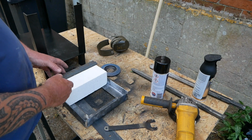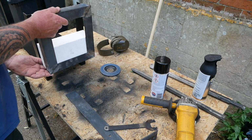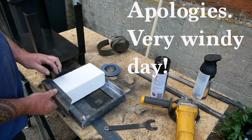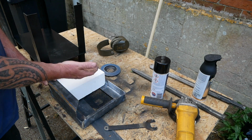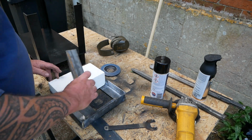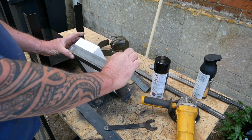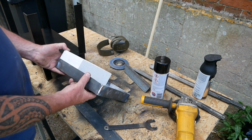So one problem that I've worked out here is that if I want to close the gate like this, there's no way of me putting a hinge between that, and I'd like to avoid putting another piece of angle iron on the inside, because then it's going to be a problem getting a nice clean fit, although I could cement on another piece internally. But I'm wondering if the easiest thing to do would be to cut a piece, a flat, weld it here, along here, so that I'll be able to hinge it, and along here at the bottom to support it, so that way it'll hinge